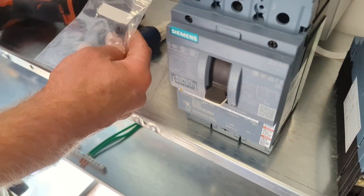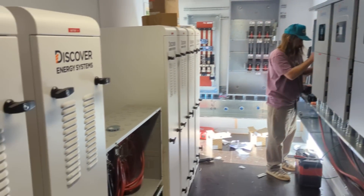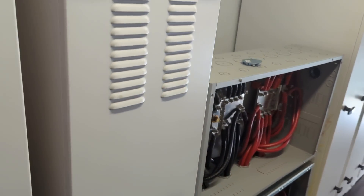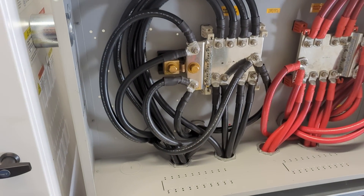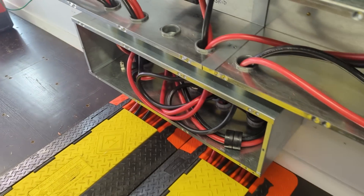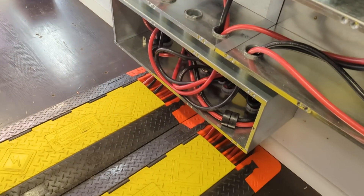Our six inverters have the solar pre-wired — two-thirds of the MPPTs each, so each inverter is getting two-thirds of the MPPT's full capacity. It's coming along. We've got two cabinets worth of Discover batteries full of batteries for testing, and our 2000-amp Midnight combiner panel, which is a beauty. We put extra wiring troughs in to hide the excessive amounts of battery cable, making sure all cables are equal length.